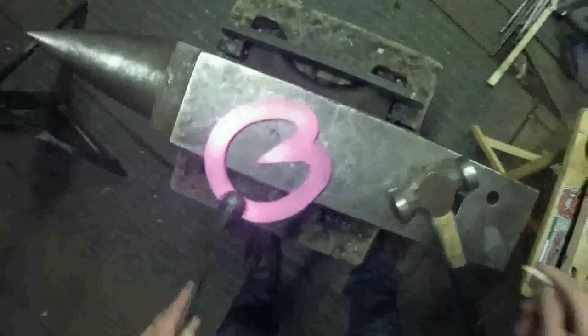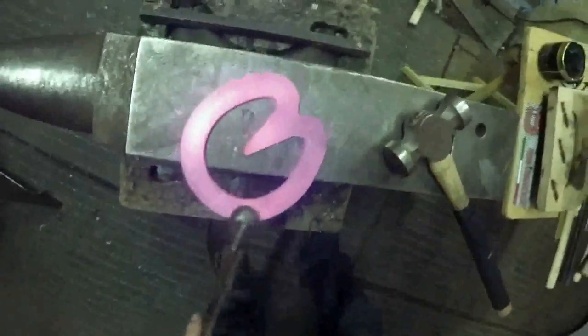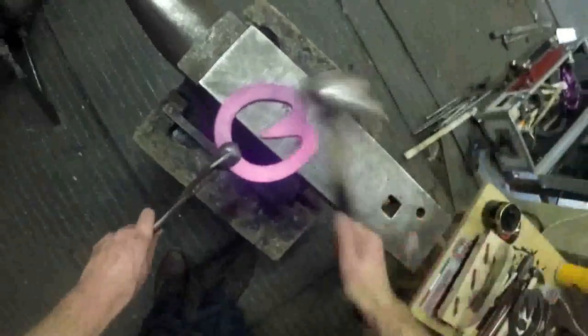Because I left that steel a little bit thicker, when I hockey stick my frog plates around, I left it thicker on there, and both frog plates there were thicker. That just gave me the tolerance that I can forge these little scarves out now.